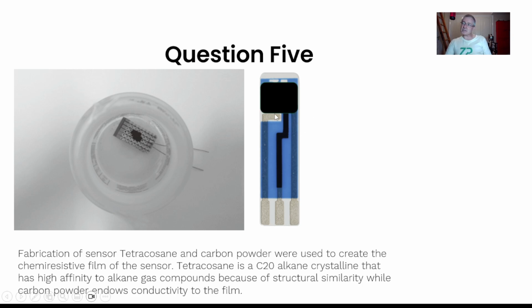I didn't quite mean to touch this electrode here. If you really look at this, I've got a conductive track here and I've got a conductive track here. So if you just drop cast between the 2 of them, you could then make a resistance measurement from here to here to here to here. If you made a resistance measurement there, then that would work in the same way that the paper is doing. The paper's just got a very, I don't want to call it crude, but it's quite a crude way of fabricating a sensor. It's not easy to scale that.